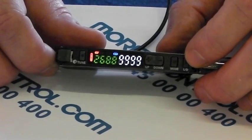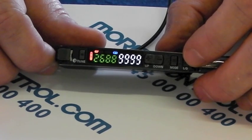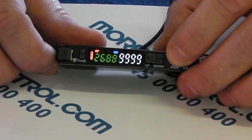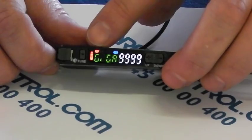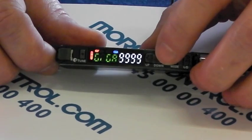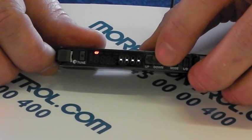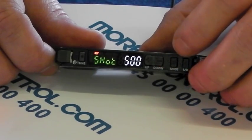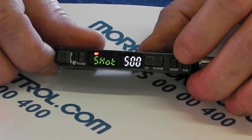For the final demonstration I'm going to need to make a few settings in the amplifier. We're going to pass an object at very high speed through the beam. Entering the mode, where it says 'giga' here — this is how powerful the amplifier is in its original state. I'm going to change this to super high speed mode, then go to the timer function and give it a one-shot timer of 500 milliseconds, just so we can actually see what the sensor is doing.